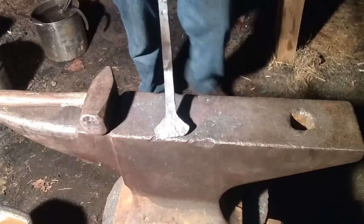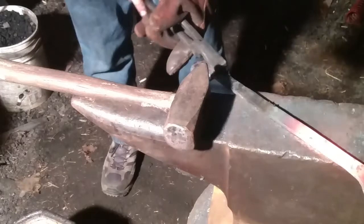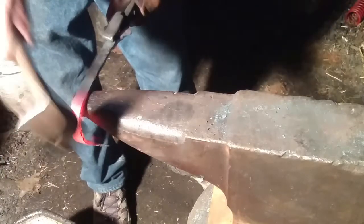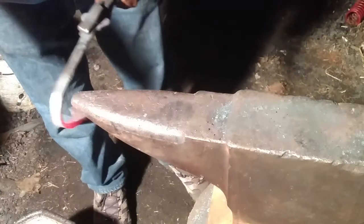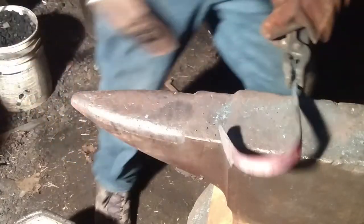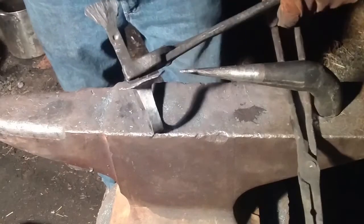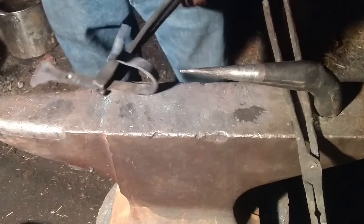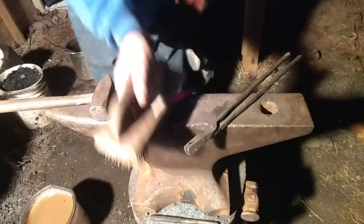Now I've just got to make some hooks real quick — take them on the end of your anvil, bend them into hooks. Got enough hook there because I am going to scroll that fishtail back out in the front, clamping in the vise to get the bend over that I want. What I'm going for is just for that to look like an organic fishtail — like it's turning, it's flipping. See there? Brush at low heat, give it a nice brush finish.